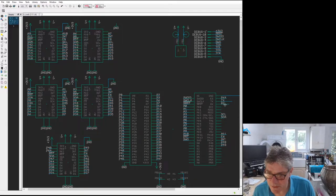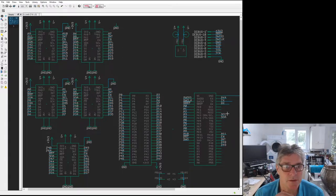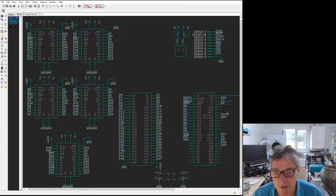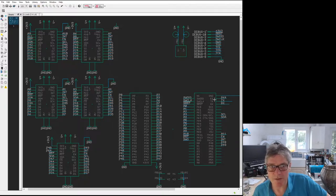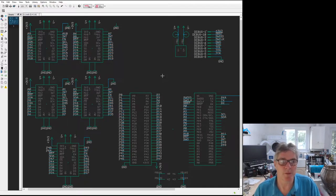What we're not using, notice, is the SCK MISO MOSI, which are the same SPI signals that are used to actually program the FPGA. So we're not reusing those. I didn't want to wire those around the board because that's just going to lower the frequency of our programming and the signal integrity. It's also somewhat troublesome. If you wire those out and people use them and install something on the board that does something, it pulls the entire system down, which we don't want to do.